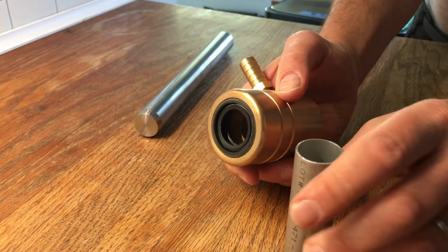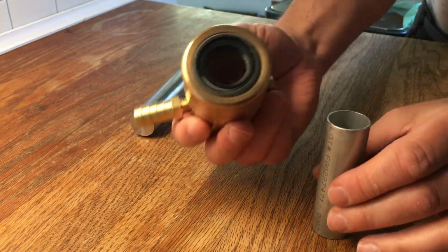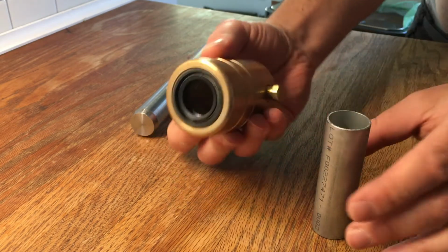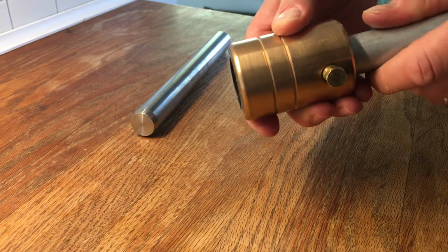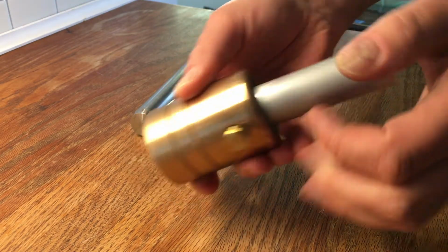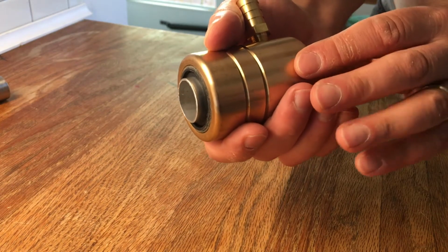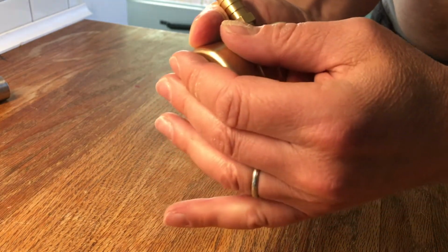You're then going to cover the shaft, the outside of the tool, and the inside of the housing, including seals, with ATF or light lubricant. Then reinstall the aluminum tool back into the housing from the forward side where you don't see springs. After that is done, you will slide the install tool back and forth inside the housing with your hand, making sure it moves easily.